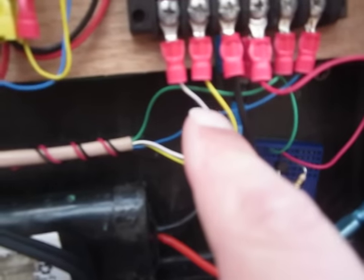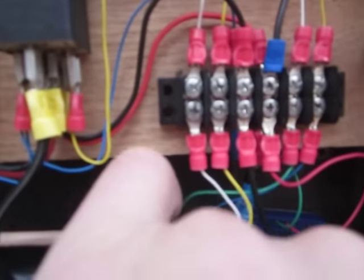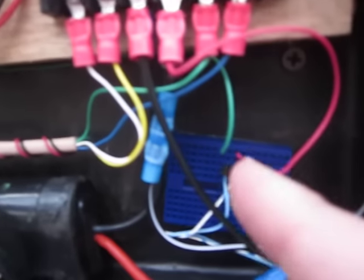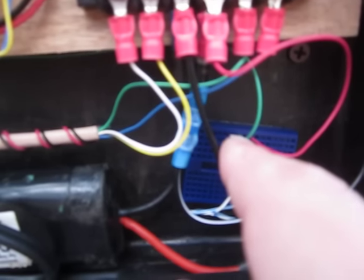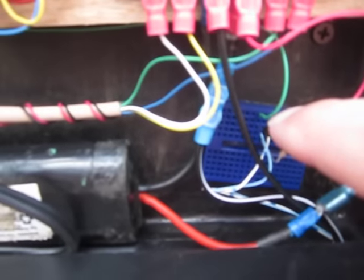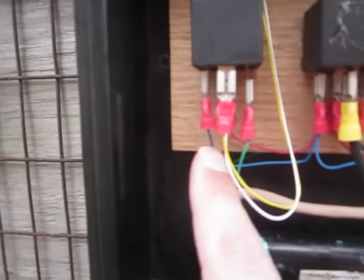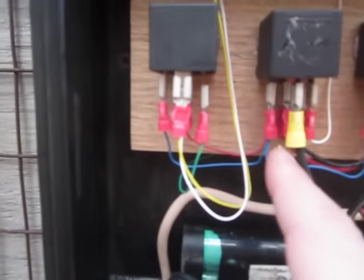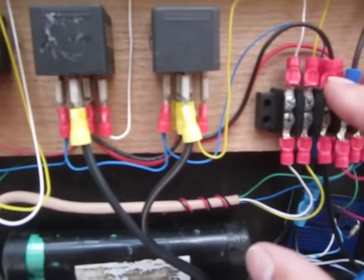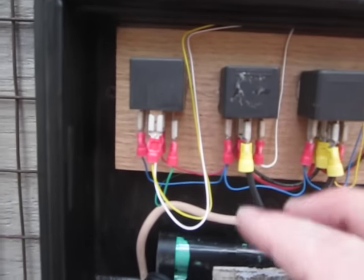And this green wire runs underneath here, way underneath. Not this green wire, this is a different green wire. Get that one out of the way. It's on underneath here, and it goes into the emitter, which is the third leg. So this takes this low voltage, low current, and powers up this side of the relay. This is the ground side. All these relays are grounded together. Turns this relay on, which sets up these two relays.